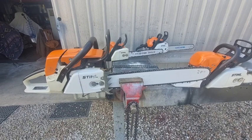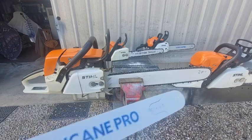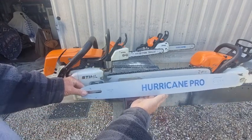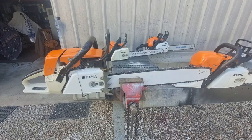The MS 380 comes standard with a 20-inch bar. Can you put a 25-inch bar on it? Sure you can — but is it going to cut well? That 25-inch bar is not going to cut very good; it's going to bog down.